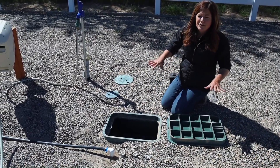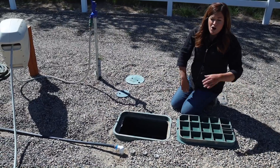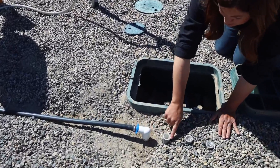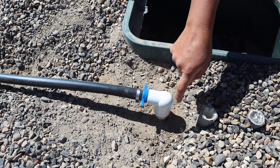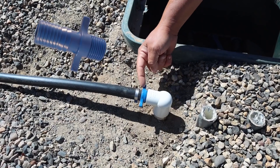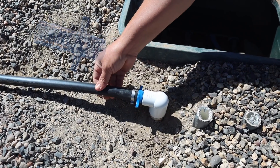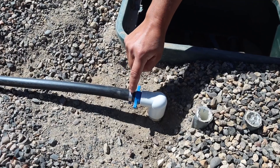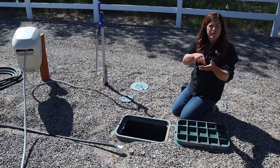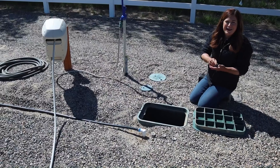Aaron is the king of infrastructure — making sure we have the ability to do whatever we want in the future. While we had the trench open, we made sure to have zone access all over the place. So it comes up with a one inch line. We have a 90 degree elbow that fits over the top of the supply pipe, and it has a female three-quarter inch thread on the inside. Then there's a blue piece with a three-quarter inch male that screws in, and a three-quarter inch barb where the tubing fits over — and it's really important to use crimpers as well. Aaron can control it from his phone. I don't have mine set up yet, so usually if I see something dry I just text Aaron.